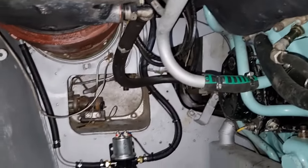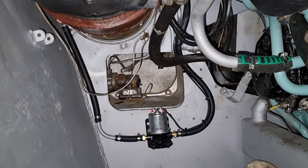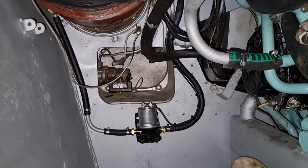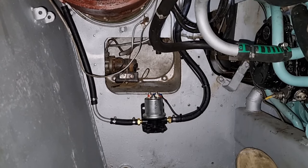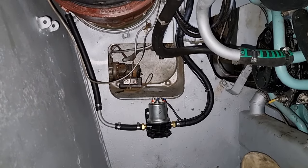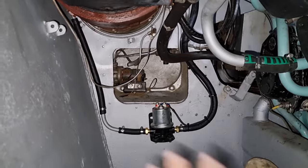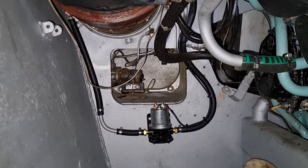The air cleaner sits above where my head is. You will notice this pipe here — that is our fuel system. We've plumbed in a brand new electric pump because it's reliable and there's really nothing to it. This one up here is the original — we haven't removed it, it does work, but considering we're not running the main fuel tanks, it's just easier and far more reliable to use the electric one. If someone wanted to go back to original, they absolutely could — we haven't drilled any holes or done anything, so you can just yank that off and use the old one.